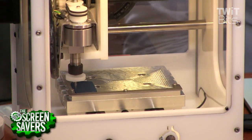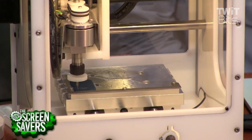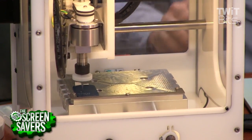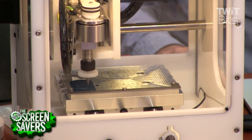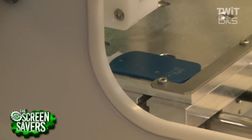The machine comes with a 1/32-inch flat end mill and a 1/64-inch flat end mill. These are standard engineering parts — you can buy them from us or from McMaster-Carr. Tool life depends on what you're milling; aluminum will wear them faster. I'm hitting go now — it'll be a little loud. Look at that, it's going really fast. Anybody used to 3D printing is expecting to wait a month — and that's it, done! Though it didn't go quite deep enough this time; we can just adjust the depth slightly and redo it in 30 seconds.